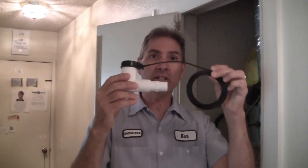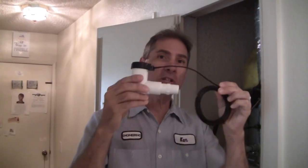What does this device actually do? You want to install this because you have a furnace with an air conditioning coil. An air conditioning coil is naturally going to extract moisture and water out of the air, drain it down a drainage system, and have it exit the furnace. It's either going to go to a condensate pump or drain by gravity outside of the residence. In this residence there's no condensate pump — it just drains by gravity outside.